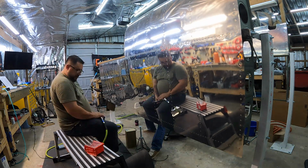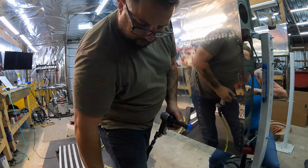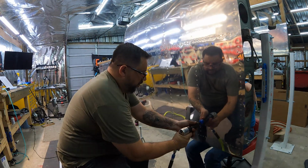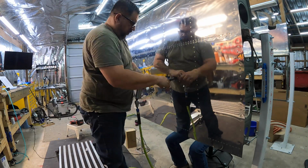And now we're finishing up that double row in the middle, and since all we're doing now is populating the missing rivets, there's no need to go in any kind of particular order. So we're just starting at one side and filling the holes in and moving right across.